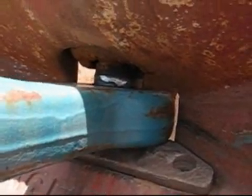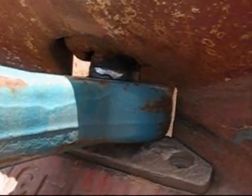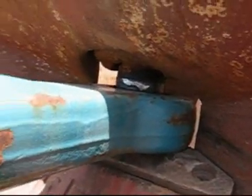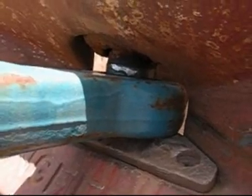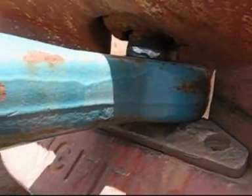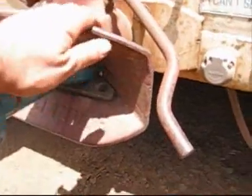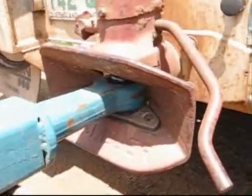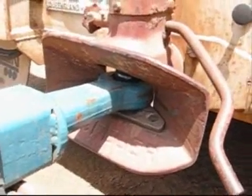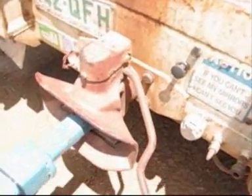Now you can see here the pin has dropped but it hasn't fully locked in yet, but it also gives us a good view of the pin itself — the bush is straight but the pin has actually got a spherical ball on it. This allows for the movement of the drawbar dolly as you're going through dips, over hills and bumps — it can pivot up and down, side to side, and twist in all directions. And the ring feeder itself, mounted to the trailer, can actually swivel — the whole thing can swivel side to side and even go a full 360 degrees if you roll the trailer, which I've seen happen where people have rolled their second or third trailer and the ring feeder's twisted completely upside down without affecting the trailer it's attached to.